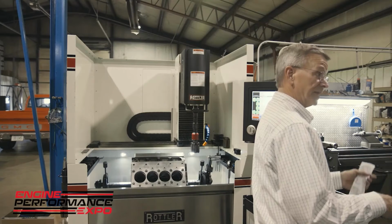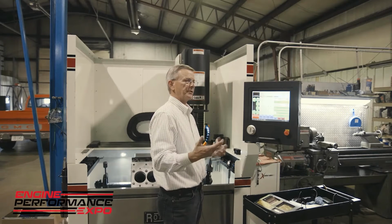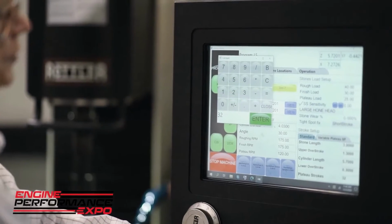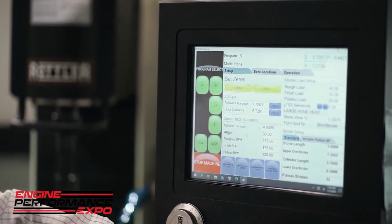We want anywhere from a 10 to 20 RPK. And for our RVK, again, we wanted 60 to 75. We're at 53. Okay, so our RVK was a little light on that one. We were at about 53 to 55, and we want a little bit more than that. So the way we do that is we're going to go in here, and we're going to back down on our strokes. And so we're going to take less strokes. We'll go down to 22 strokes on this particular motor just to check.